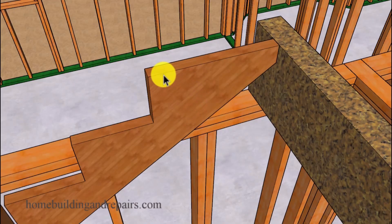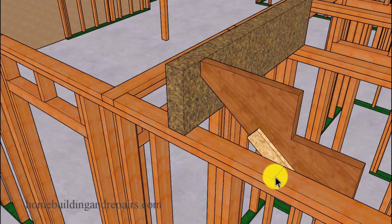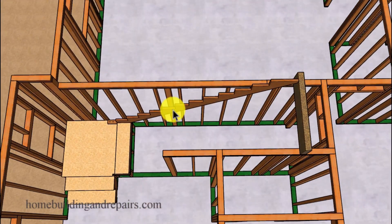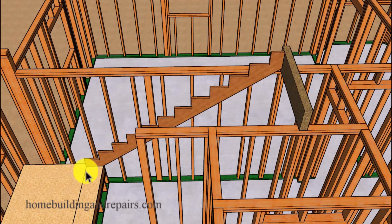However, if that won't work for you, you can always have the stringer run a little longer and then line it up with the measurement you've selected that will work best for the upper floor framing. Because sometimes if you have a situation like this and it doesn't line up, you can re-cut the stair stringer and lay it out with smaller or larger steps as long as they meet your local building codes — again providing us with a good reason why we only want to lay out one stair stringer. I can't tell you how many jobs I come to where the stair stringer is off an inch or more because somebody built the floor first or didn't know how to locate the stair head out. So if you're not really good with math, your stair stringer measurements might be off a little bit, or you're just looking for the easiest way to locate the support beam or stair head out in the floor framing, then this just might be your best option.